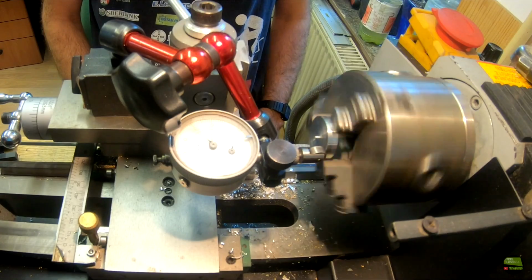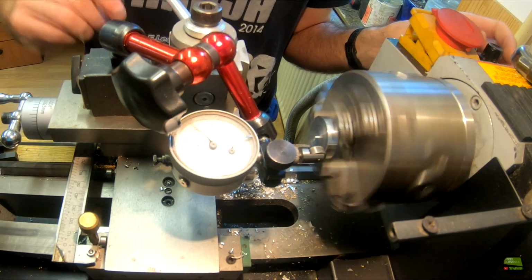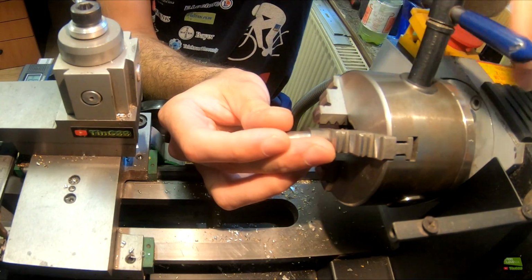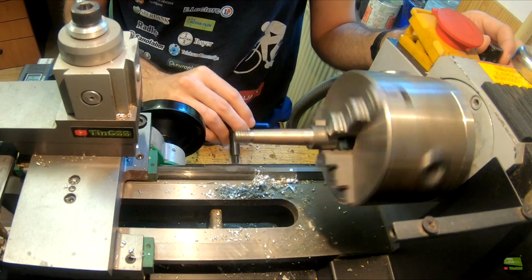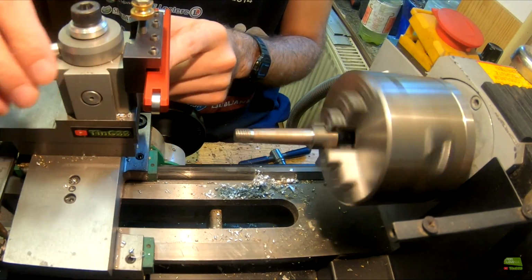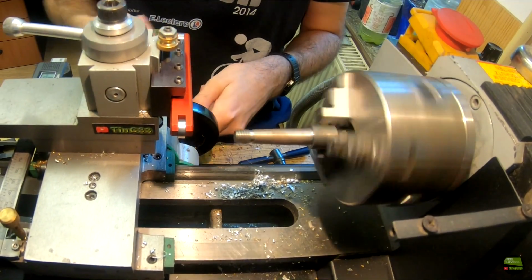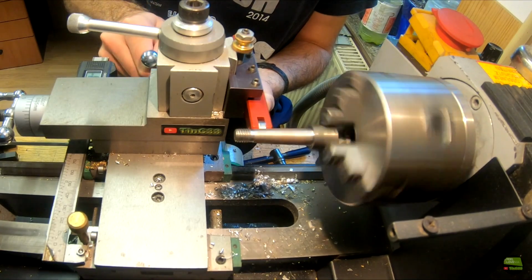But then a piece of chip came to the wheel. So once again, but it's really badly seen. Because the bearing is on both sides of the tool, it's really simple to center also from the other side. I didn't tell you yet, when you want to center some workpiece, clamp it in a chuck and just lightly tighten the jaws. Then after centering, stop the lathe and tighten the chuck seriously.